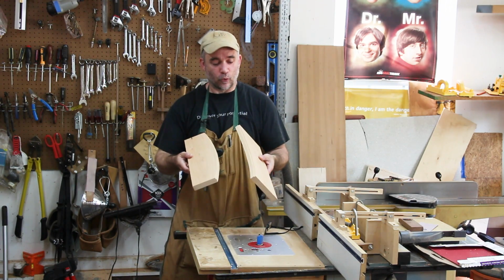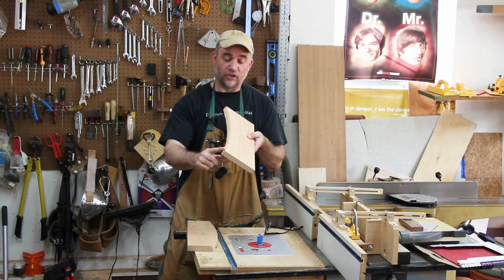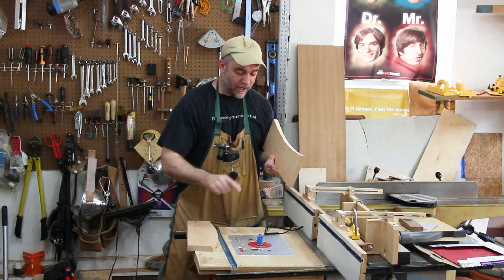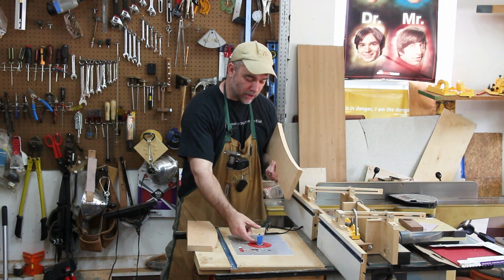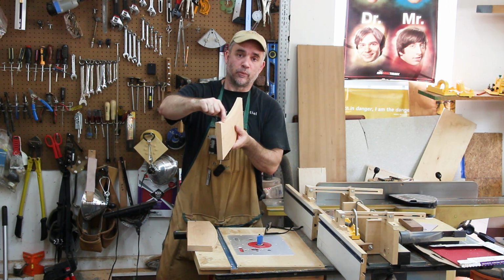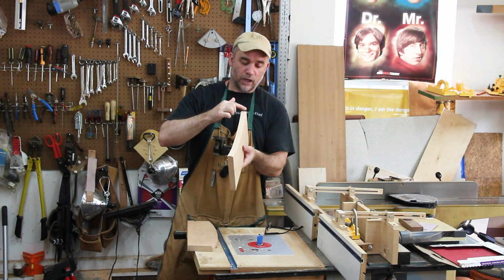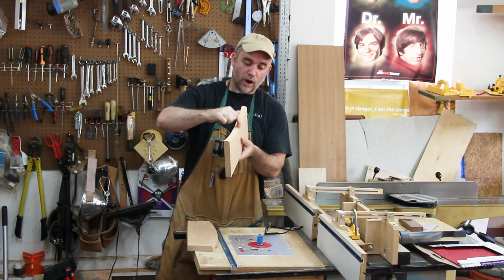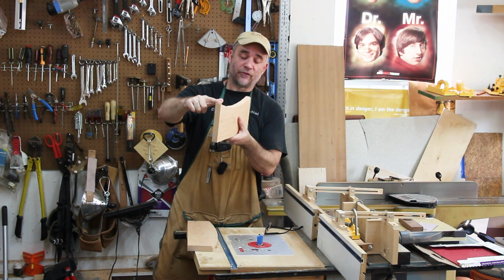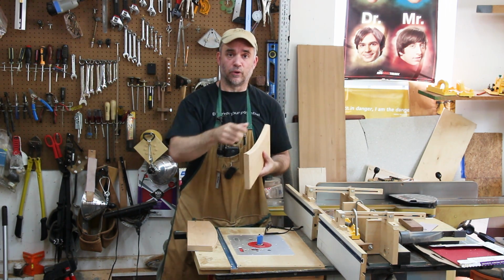After splitting this cutting board stock apart, making sure to keep the bandsaw blade in between the channel that was created with the plunge router, I can now use a pattern bit which has the bearing underneath the cutters, and the bearing is going to track along the routed portion or half of the channel that was cut in half. So the bearing will track along the routed portion, and the cutters will flush the bandsaw portion down to the surface that was made from the plunge router.